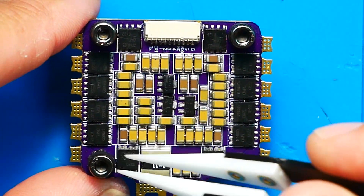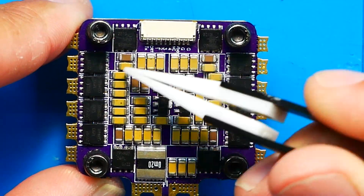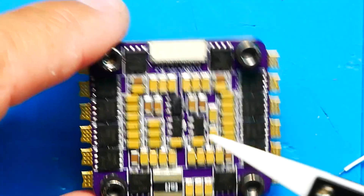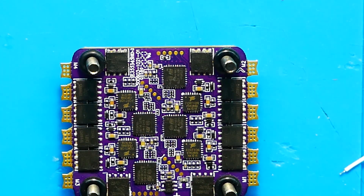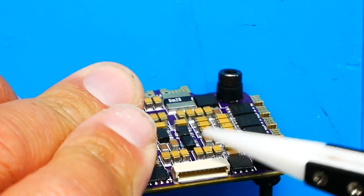On the bottom of the ESC, circling all the way around you can see all your FETs — just gorgeous. You've got your center fill, a couple of regulators, tons of capacitors, and your shunt resistor which senses your current. The connector loops up to the flight controller and makes all the connections easy. One thing they did not do is lay out solder pads on the ESC side of the connection — so if you break the connector, you won't be able to solder down to the ESC directly. You can solder to the flight controller side but not the ESC. However, it is on the bottom, compact, and out of the way — there's no reason to break it.